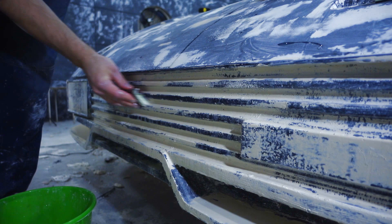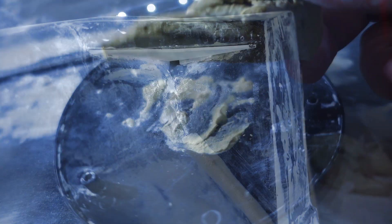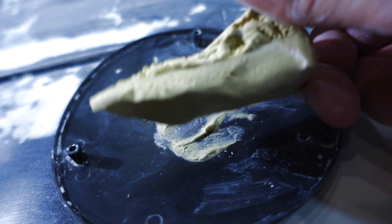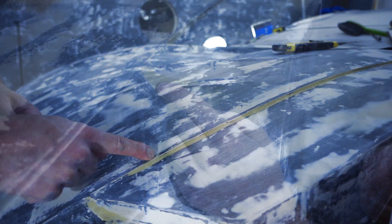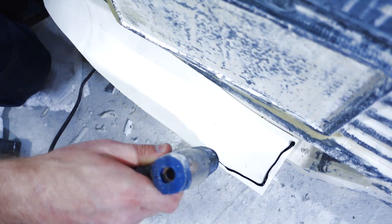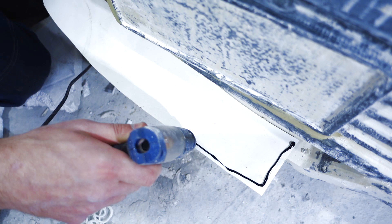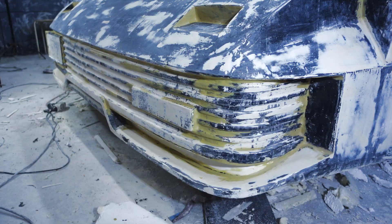After finishing the bumper with PVC plastic, I leveled all the sheer surfaces of the front part. All joints will be lubricated with sculpture plasticine — the polyester resin doesn't erode it and it helps to easily refine the surface of the model. I also leveled the bumper axles with foamed PVC plastic. This is what the model looks like after a complete rough rework of the surface.